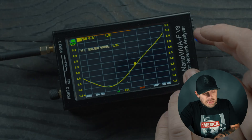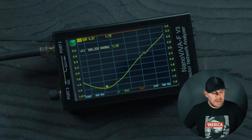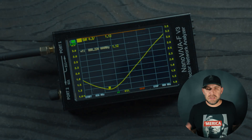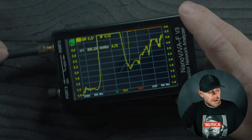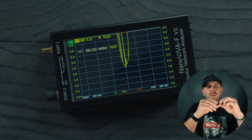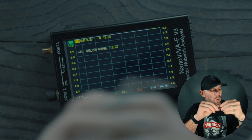Let's check out the little stock antenna — these come with almost all your nodes. The basic little guys. There's a decent little sweep, and it looks like it's going to be down in the 900 range, roughly around 890 MHz. I know from using these node to node they perform fairly well — quarter mile, half a mile maybe. Some of you may have better reports than that.